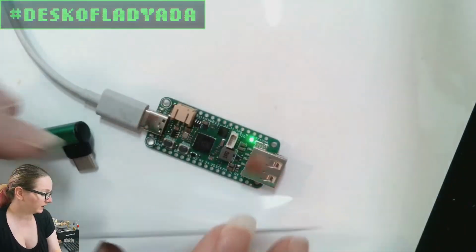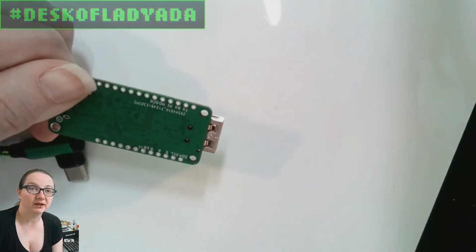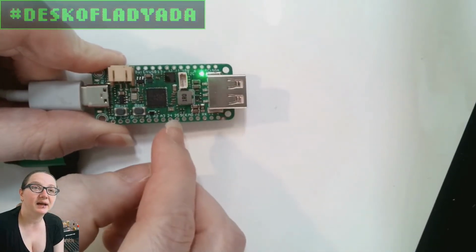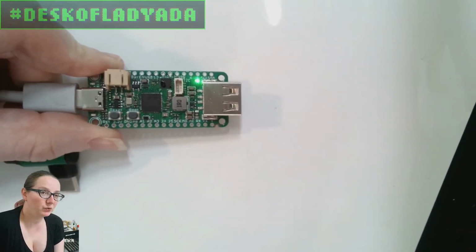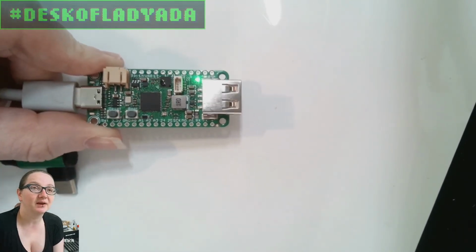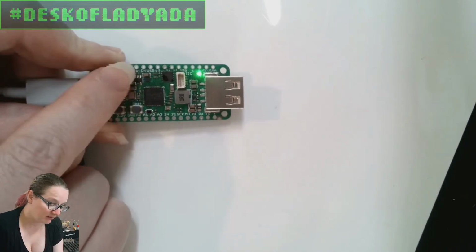So instead of the e-ink, this one has a surface mount USB-A connector. In a previous Great Search, we showed how to get this connector, and it makes it easier, with less through-hole soldering, and also makes the bottom nice and flat. And then over here, this is a TPS61023, which is a 1 amp 5-volt boost converter, and that's great because even though this is connected through USB and this gives you 5 volts, maybe you want to run this off of a LiPo battery.